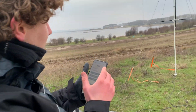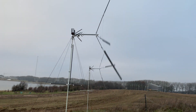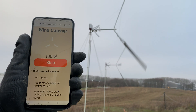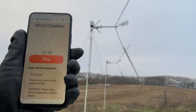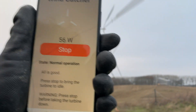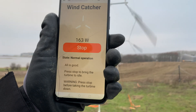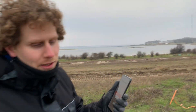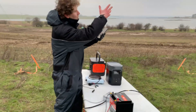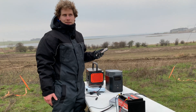I connect to the turbine and press start. It's spinning up, and one benefit of the battery is that it can put energy in right away without needing to think like portable power stations do. The turbine will try to deliver as much power as possible, but will be constrained by the battery. Once it reaches full state of charge, the system will limit the current going into the battery, and the turbine will detect this and reduce its power output - automatically balancing and charging the battery in a smart way. It works with both lithium and lead acid systems.